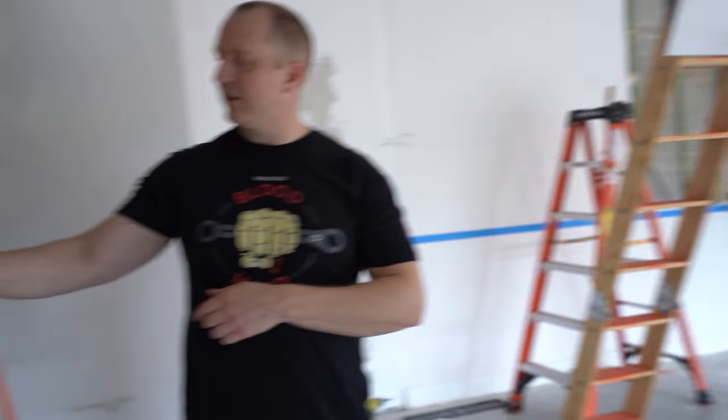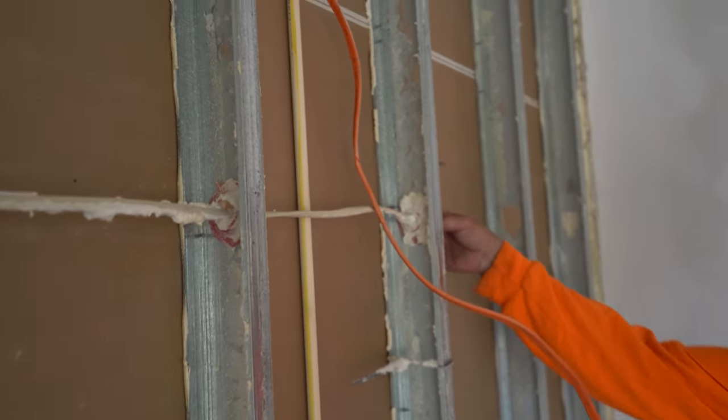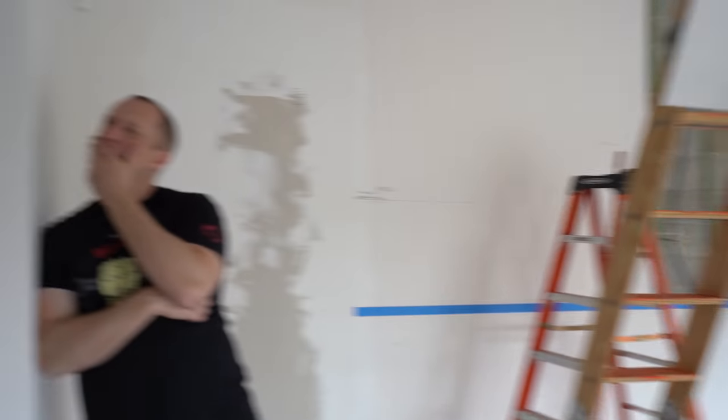They use zip ties and want to get to the center of the two-by-four because drywall installers are only allowed to use inch-and-a-quarter screws - if they use inch-and-a-half or two-inch screws they're liable for any electrical damage. That's code for five-eighths-inch drywall. As long as you stay in the center of the stud, you won't have any issues with your wire. This area will all be blocked out because the pressure washer weighs a lot.